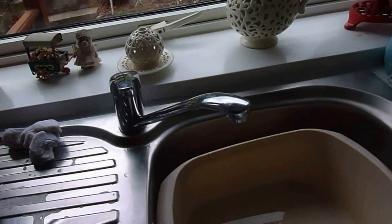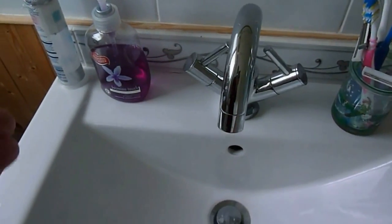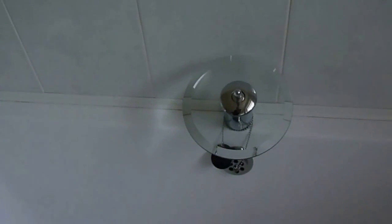So it is a bit of a problem. The best bet is to go into your bathroom. Now, in a modern bathroom you'll likely find mixer taps on the basin as well — same problem. Even the bath tap may have one of these fancy mixer taps on it. So this does make sorting out an airlock quite difficult if you've got these type of taps.